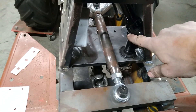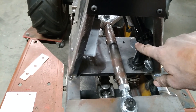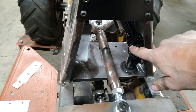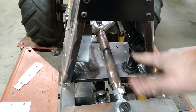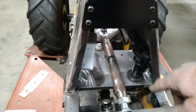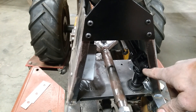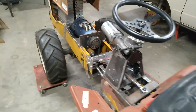The problem I was having is the way these U-joints are phased. There's 90 degrees between this part and this part, and there's a mirror U-joint up top. From the factory, the Nissan driveshaft U-joints were out of phase by about 45 degrees — whereas on a proper driveshaft they should be in phase, lining up directly. I had mimicked that without knowing why, and the problem was that near the extremes of left or right travel the U-joints were getting in a bind. So I just undid and redid them — took the assembly apart about three times to get it right, and it's right now.